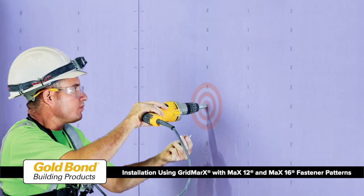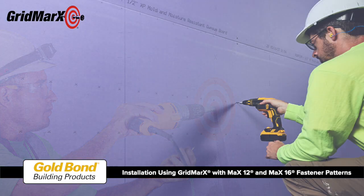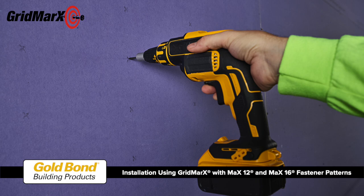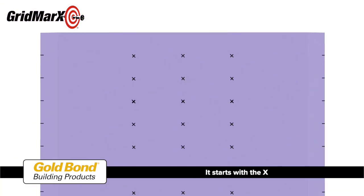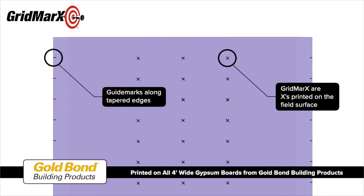In this video, we will explain how GridMarX installation guide marks can be used to provide a faster, more accurate installation in commercial construction. First, it all starts with the X. Grid marks are X's printed on the field surface and guide marks along the taper of all 4-foot wide gypsum board products manufactured by Gold Bond Building Products.